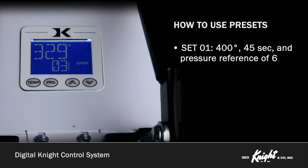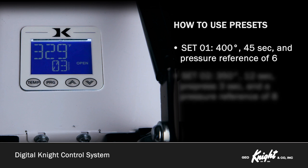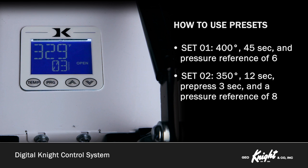Preset Set01 will be for 400 degrees and 45 seconds, with the pre-press off and a pressure reference of 6. Preset Set02 will be for 350 degrees and 12 seconds, with a pre-press of 3 seconds and a pressure reference of 8. From the normal operating mode, press Program.